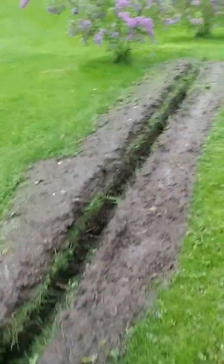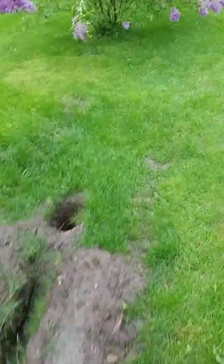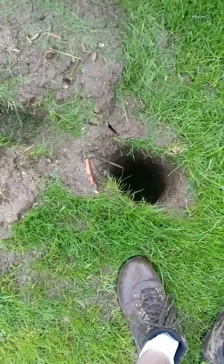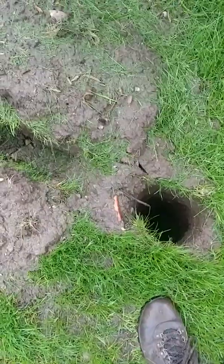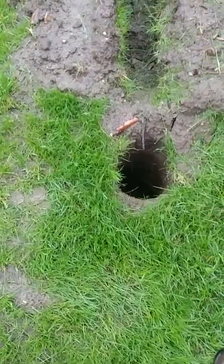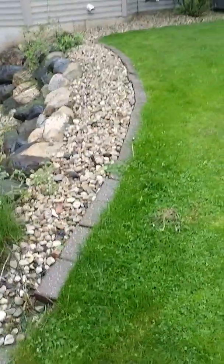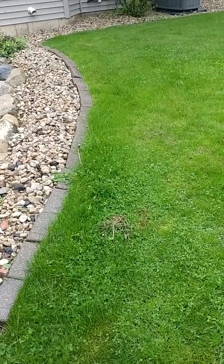I'm making a little dry well at the end of each run. I have a six-inch two-horsepower auger, so I use that to dig the hole, put fabric down in there, fill it with rock, and then in the winter the water has a place to go so it doesn't freeze. I'm using regular NDS pop-up emitters — they come with the weep hole now so I don't have to drill that — and I just let them weep into there.